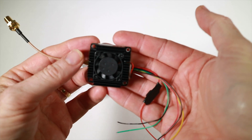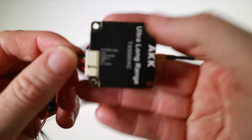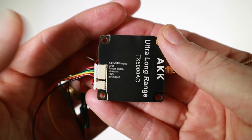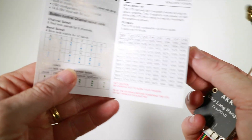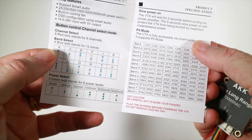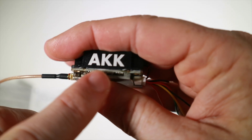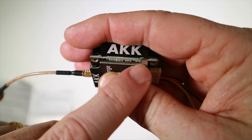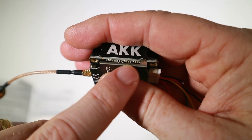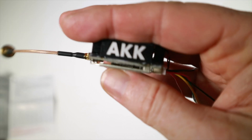Here's the unit out of the box with the connectors on. There's only a connector — no solder points — but they're nicely labeled, and you can see the 14.6 to 28 volt requirement. It uses smart audio and it does have a 5 volt output for the camera. Looking at the instructions, they give the bands and show what the LEDs indicate. You've got eight LEDs showing the channel, four LEDs giving you the band, and three LEDs telling you the power. The eight are red LEDs, the four are blue LEDs, and the three at the end are green LEDs.